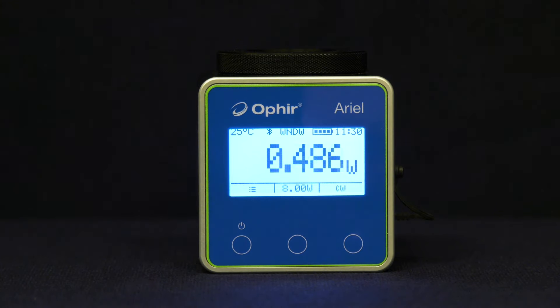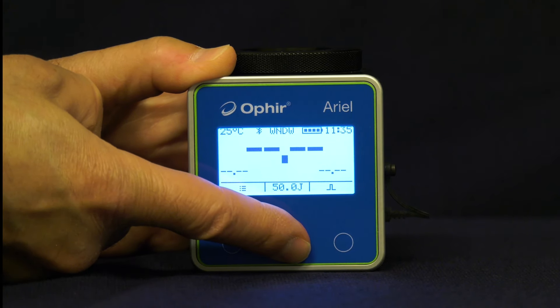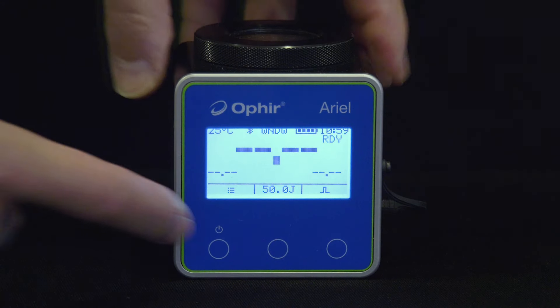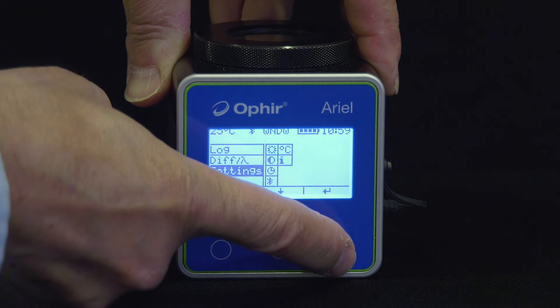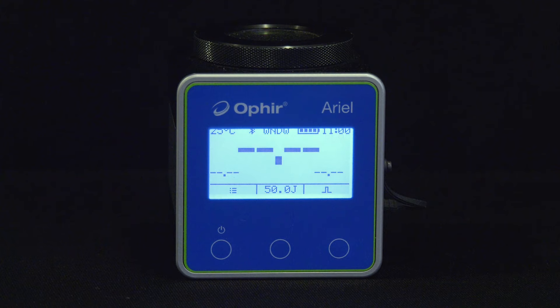From 200 milliwatts up to 30 watts, it can dissipate heat continuously. From 30 watts up to 500 watts, it can do so intermittently — up to 20 seconds at a time for 500 watts. We now set the range by pressing the middle button and toggling to the most appropriate range. Note that since we're in short exposure mode, the range is shown in units of energy. We want to select the lowest range that's still higher than the expected pulse energy. Additional settings are done through the menu: press the left-hand button to open the menu, the middle button toggles through menu items, and the right button selects. The left button closes the current menu and returns up one level. Note that while the menu is open, measurements are stopped.